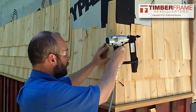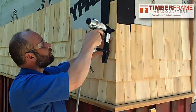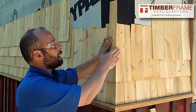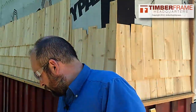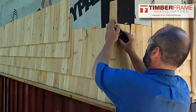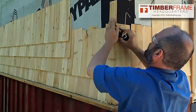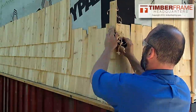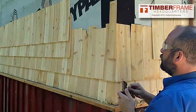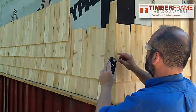Once you've gotten that all roughed out, go ahead and put that shingle up. You're going to put your two nails and then one nail up there so that when I'm planing it, it doesn't move. A nice sharp plane makes fast work. I do like to leave it a little bit proud of the other one, angled slightly so that when I put that next shingle up it's a nice tight fit. As you're getting close to the end, start going slow.